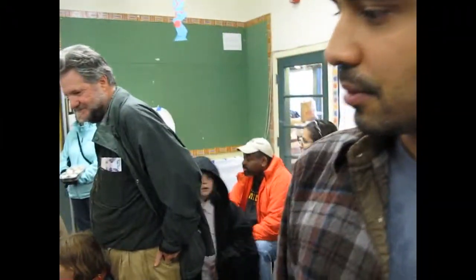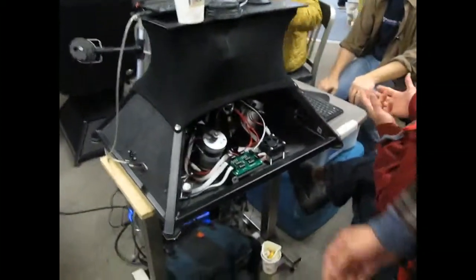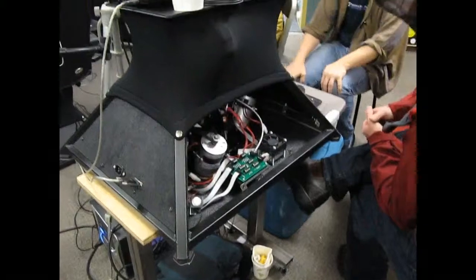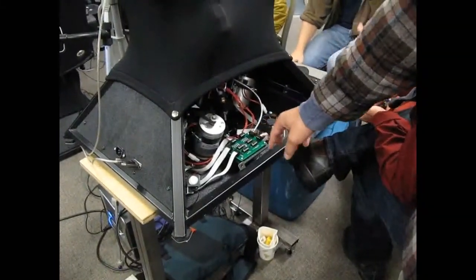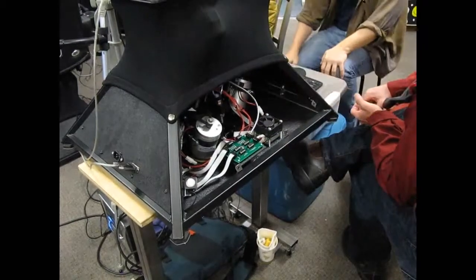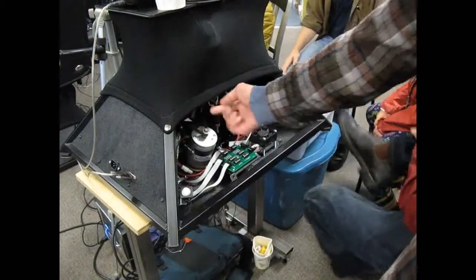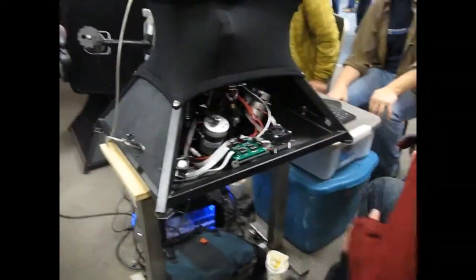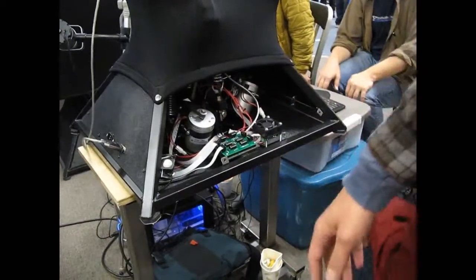Maybe you could show me what we've got going inside the actual chair here. Sure. So this is just a standard serial port, which is what the computer is sending as signals to here. There's a PIC that interprets that data — it's just 0 to 255 on both axes. Two of the other PICs are counter chips for the quadrature encoders and these wheels here that let us know what position the chair is in at any given time. The other one is just a Schmitt trigger and a bunch of electronics.